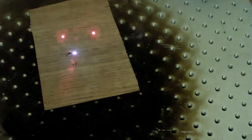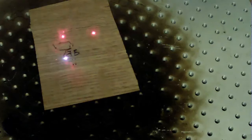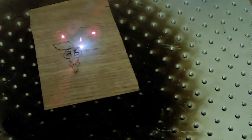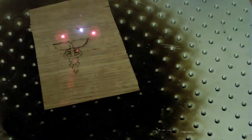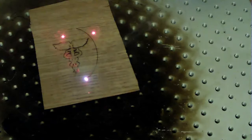It's going to try to cut that very center part but it's not a big deal — it's just easier to let it do that than to delete that part out. All we're worried about is that outside line. As you work with this and fine-tune your laser, you may find you need to adjust your offset. Working with different materials — for example leather will swell a bit, whereas wood won't — so you'll probably need to adjust your offset a bit to make everything come together, but this is pretty close.